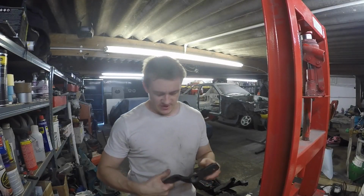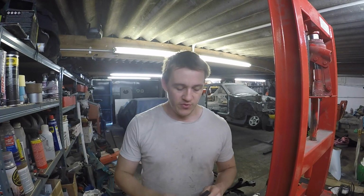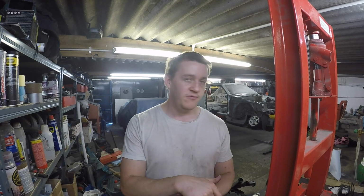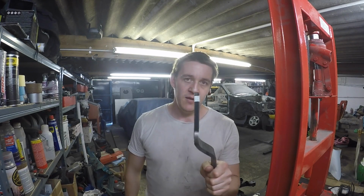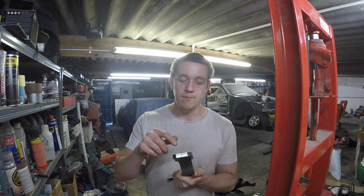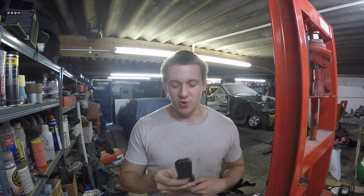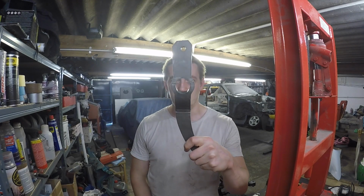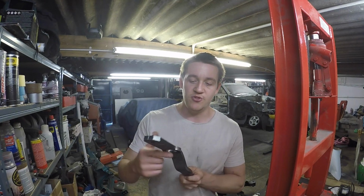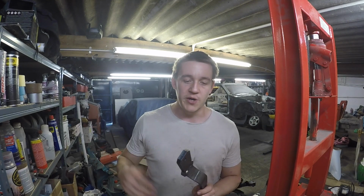Right, you may notice that this is a different colour and this is bent. The blacksmith did bend it, but famously they can talk, and I was there for 3 hours listening. But it's bent now. I'm happy with it, but when he did the first bend, the radius was a bit big because the V-block that he used in the brake press was quite big, I think, and it's deformed the hole, which is fine. I can just die grind out the bottom, and the top's still a great control for where it goes, and it will still weld up fine.